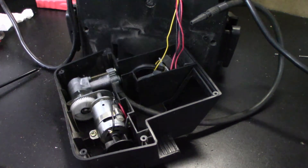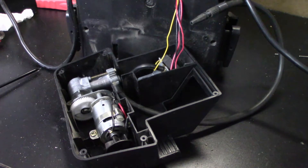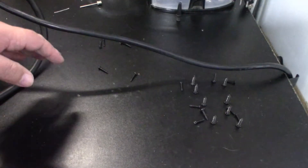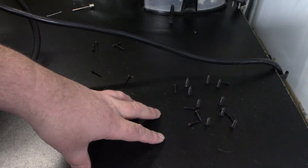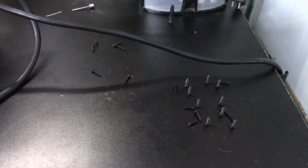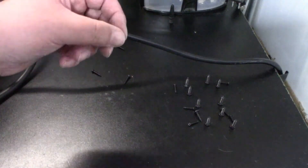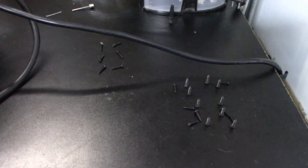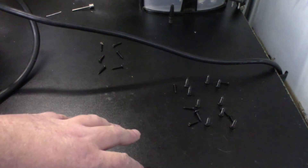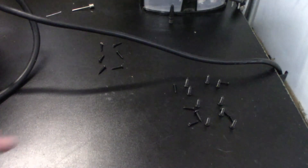For those of you wondering how to keep track of where your screws go when putting things back together — I've said this in previous videos — the best thing to do is lay out your screws the way you take them out. When I first started out, I would take a piece of paper, draw the pattern of what I was taking apart, and set those screws on the circles so I knew exactly where they went. Either draw out a plan or use a separate table setup so you don't accidentally mix up your piles, because sometimes specific screws have to go to certain areas.